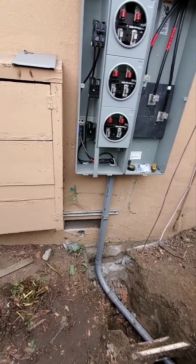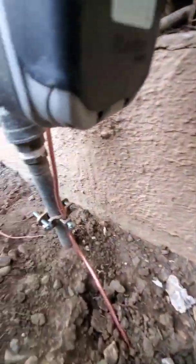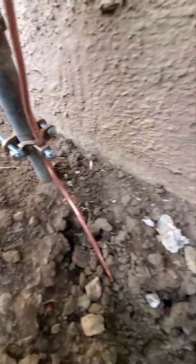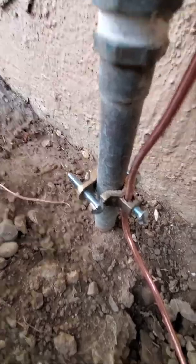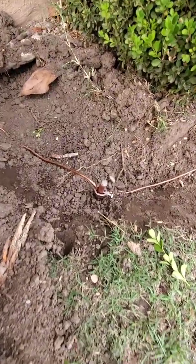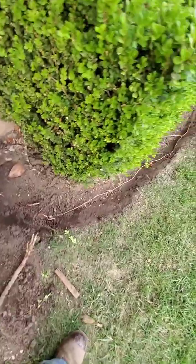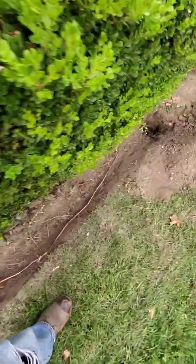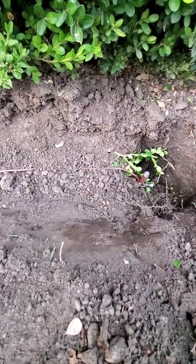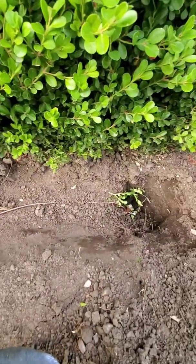On the other side we have the ground bars. Right here the ground wire is connected, coming from under the house. We have what I think is called an acorn clamp — that's where it goes first, then it goes to the ground bar. This ground rod is 8 feet long, 5/8 inch. We also dug another rod over here, also 5/8 inch, and the wire gauge for that is 4-gauge bare copper.